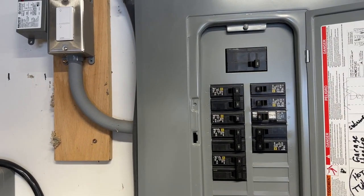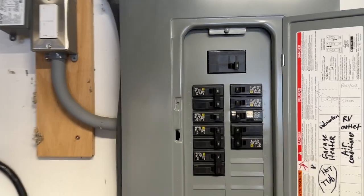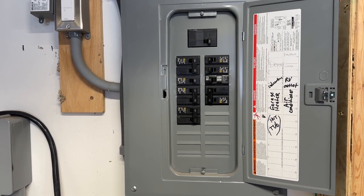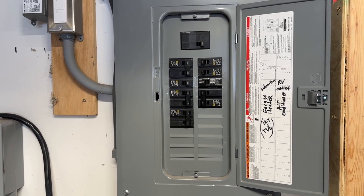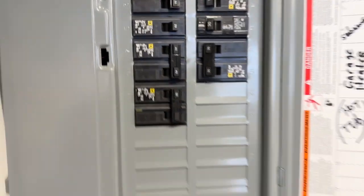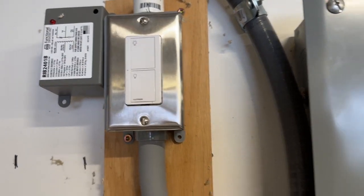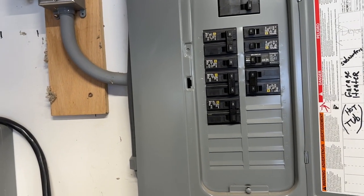This is not my first experience utilizing this particular relay in a box — you can see there's another one right here in conjunction with this smart switch. We're now in my garage at my sub-panel. When I built my AV system I utilized multiple subwoofers — to be precise, I have three outlets for the subwoofers alone on their own breaker. It's a 20-amp breaker because of the power draw of the subs, and again the smart switch alone does not have the rating to support it.